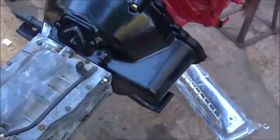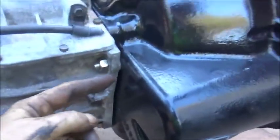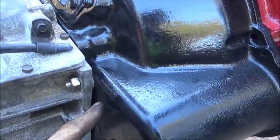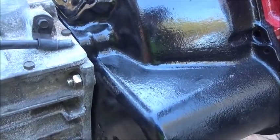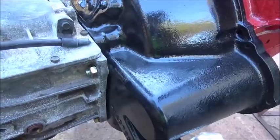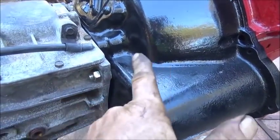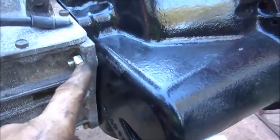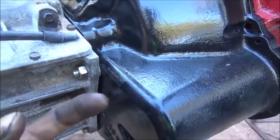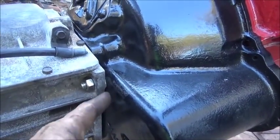On the other side, all I ended up doing was drilling all the way through, and after I drilled through I realized the casting wasn't thick enough to actually thread it properly. So I tapped it anyway but I threaded from the backside and just threaded the bolt in, tightened it up, then put a nut on it so it would squeeze together — because there's not enough threads in it to hold by itself.